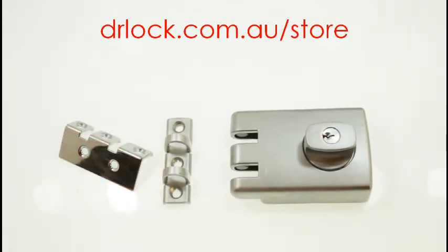You can see a bit of the difference there. The difference is that it actually has more of a right angle, and it has two large holes where you can put some really good screws in the other direction to get more strength into the lock. Now the lock relies purely on the strike, so if the strike isn't strong, the lock's not going to be strong.